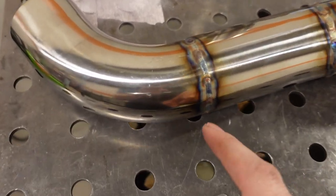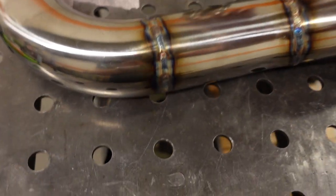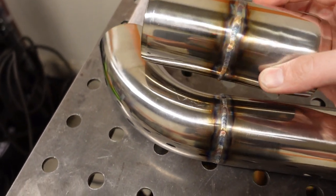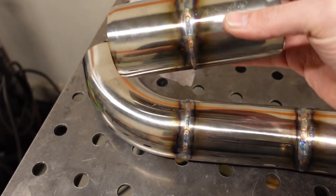The other thing you can compare is the heat affected zone. That's this wide area. You can see the blue slash brown line there to there. In theory, I think you're gonna have a smaller heat affected zone. So maybe depending on which spots you compare here, you'll have a little bit less of that HAZ, heat affected zone.